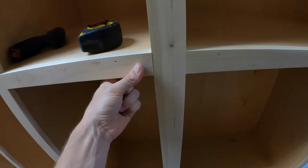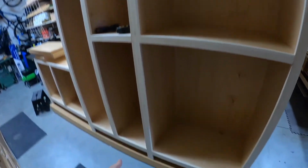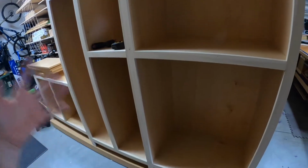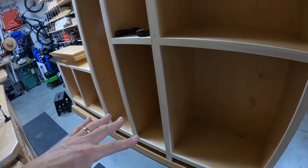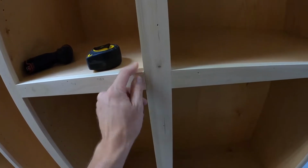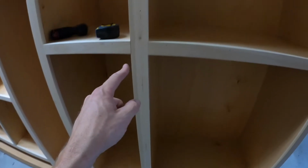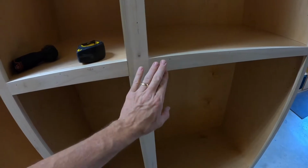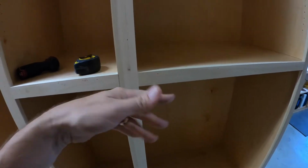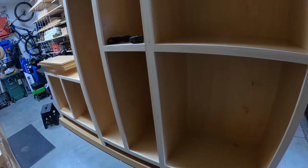So once I take that pocket screw out and the cabinet screws, those three pockets, they will separate the cabinet. And then when I go to the job site, I will put this back together just like it is and then secure it. Then once the glue is done drying, I'll put glue on this joint here, all three, top, bottom, and middle. Once that's done, I'll sand this and it will look like this. So you won't really be able to tell how this cabinet got in there because of the way that it's glued up and everything.